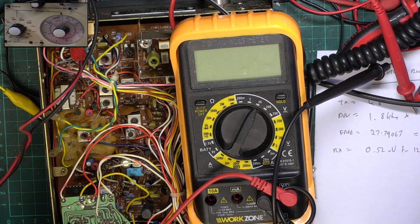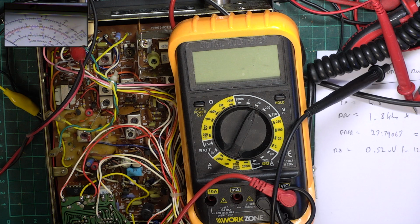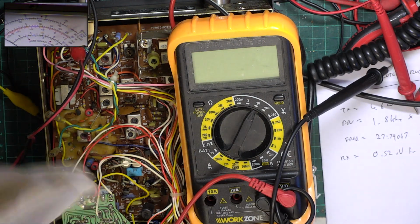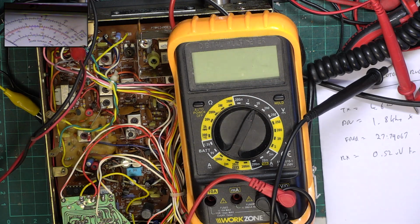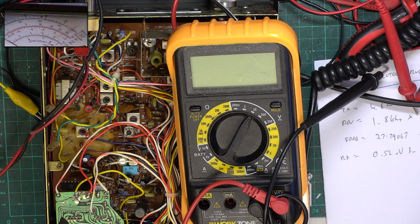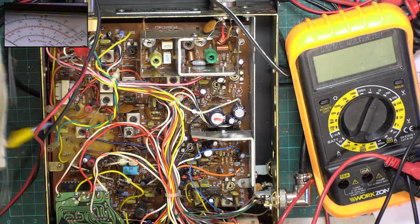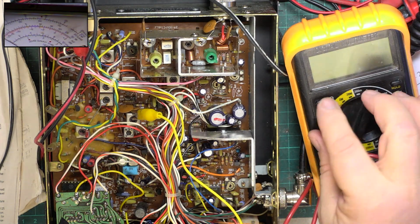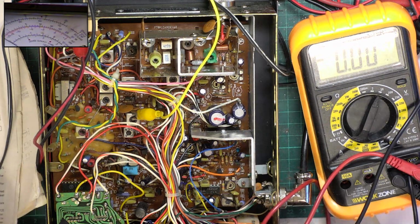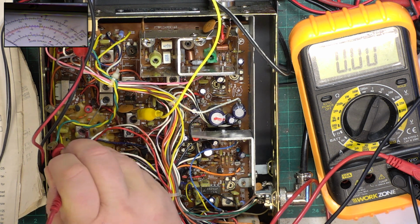Let's put that back to there. So I always have to get the service manual out for these because I cannot remember the procedure. We have a nice copy of this which was sent to us by a viewer, but I'm using the dodgy copy because that's what happens here. So we select channel 40. That's channel 40. We need negative, not to chassis but to real negative. So we'll use one of those cans for real negative, and we want the far side of resistor 4, and we've got 3.77 volts. Well, we had it while I got the prod on it.